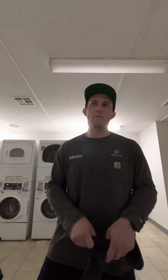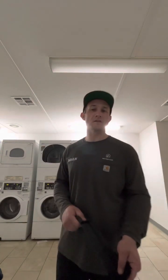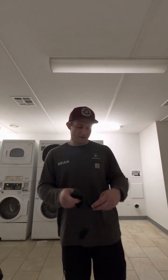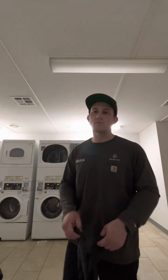It makes the wattage that you have available go real quick because heat is such a big wattage consumption. So like a tankless water heater could be like 3,000 watts already. But if you went propane, it would be 500 because it's just the electric part lighting the flame for the propane to burn and heat up the water. So that's one thing. If you can get propane stuff, I highly recommend it.